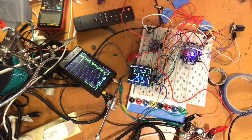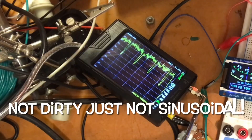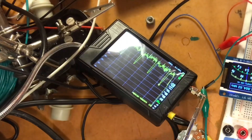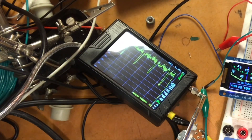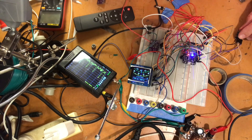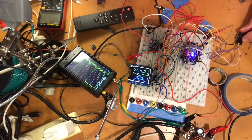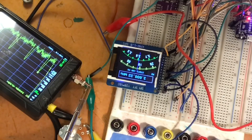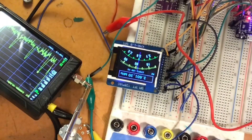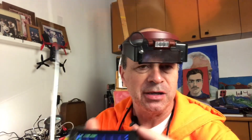As you can see on the tiny SA here, the output is as dirty as all hell — especially on the lower frequencies it's nowhere near sinusoidal, so it needs some filtering. But I've got the trusty TS520 on receive around the 3 MHz band, and you can hear the signal come in as I tune up. That is my beautiful analog retro VFO — and I finally got to use my tiny SA for something.